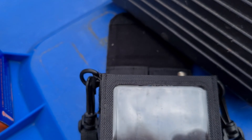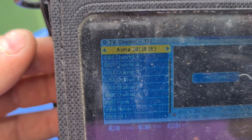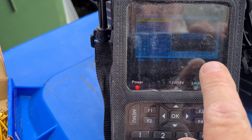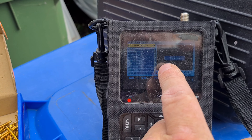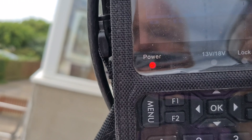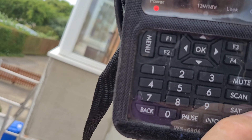So now it's a case of mounting the dish. Here's the quad LNB — it looks like it's already rotated to the right angle anyway, but you've got a little bubble there just to check when you put it on the arm. You've also got your four F-connectors there, so what I'm going to do is terminate the F-connectors, connect them to this, and then push the LNB onto the arm of the dish. This case here actually slides down to cover the F-connectors.